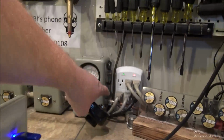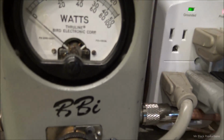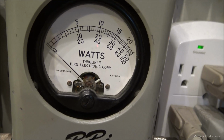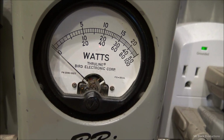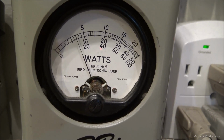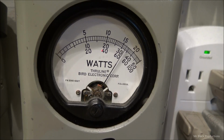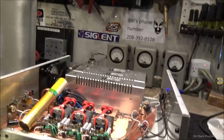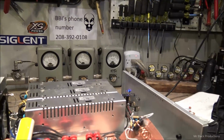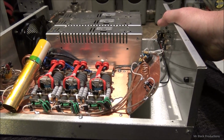Barely even wiggling. So now let's come on over here, guys, and we'll click that up into 2x. So now with the needle all the way over there on the 100 scale, that's 2,000 watts. And the hash mark between the 40 and the 60, that's 1,000 watts. So every large hash mark after that's an additional 200 watts of power. 14 and some change. 3/10 of a watt of input reflected. The 1400 going out. And you can actually drive this just a little bit harder. But this thing is right.